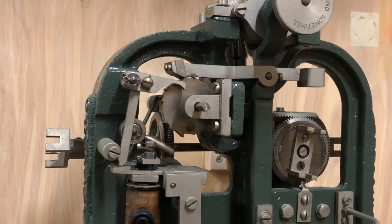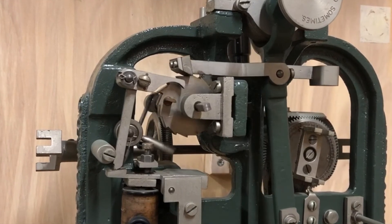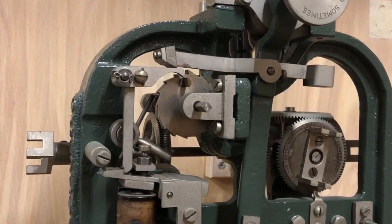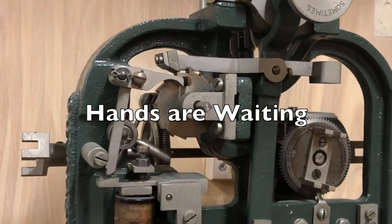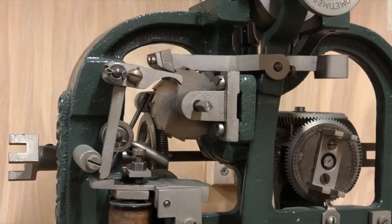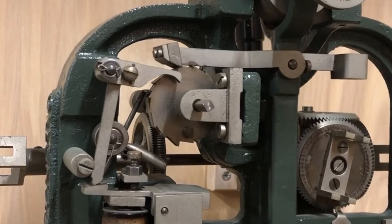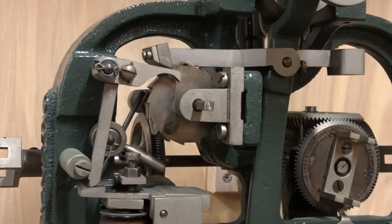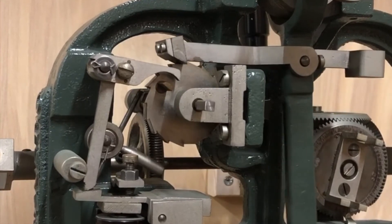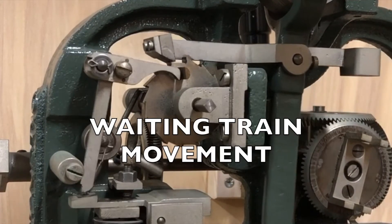If the hands turn one half minute in 27 seconds, doesn't the clock run too fast? No — that's the brilliance of this movement. It is a slave clock and does not contain any time regulating parts. The only thing the pendulum has to do is turn the escape wheel one revolution in less than one half minute. In that revolution, the hands will be advanced one half minute. The pendulum is then disconnected from the escape wheel. The time train is now waiting. It will start moving again when it receives a start impulse from the master clock. This happens every 30 seconds. So now you can see the movement is appropriately named: the waiting train movement.